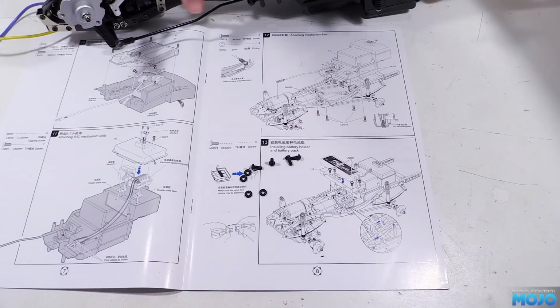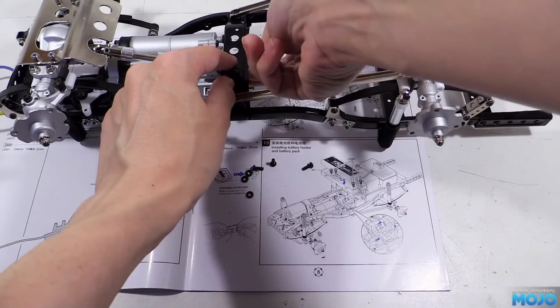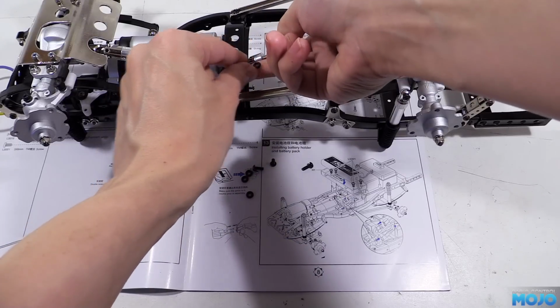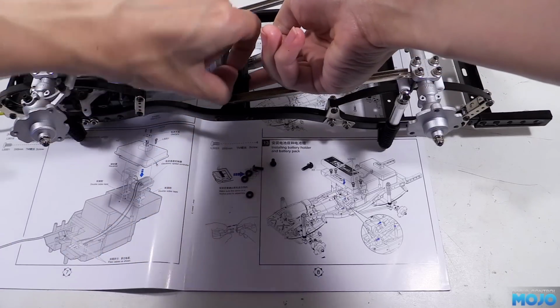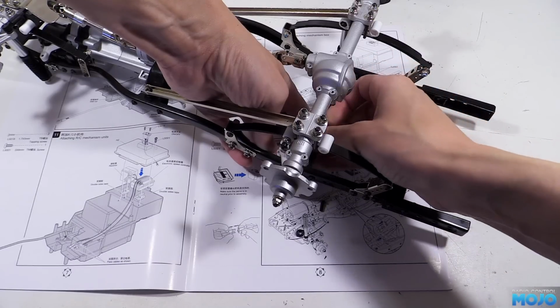I'd highly recommend doing this over a tray or something with sides, as getting the O-rings over the screws is easy enough, but when trying to line them up on the box it's all too easy to push one of the other screws out, dropping both the screw and the O-ring.